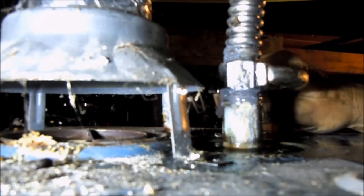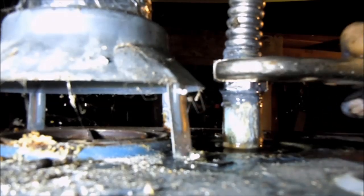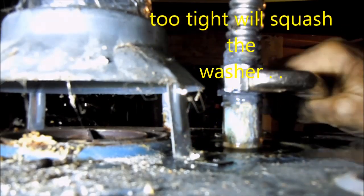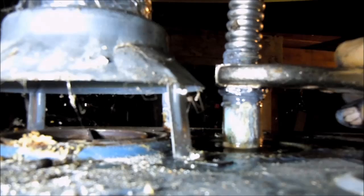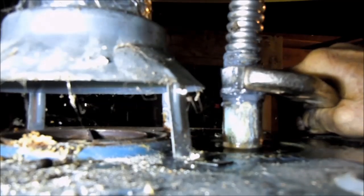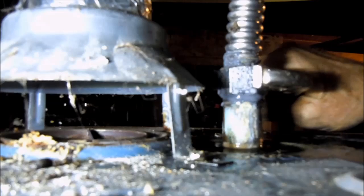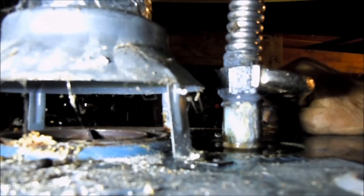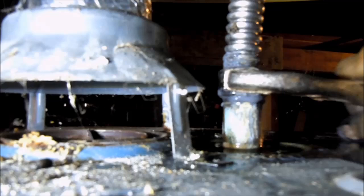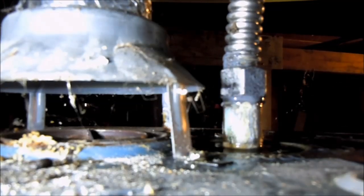So it's clamping down slowly but surely. You never want to over-tighten these — you just have to find that sweet spot, somewhere between hard and light. Some people say if you can do it hand tight and it's a clean thread you might be able to make it work, but hand tight plus maybe half a turn. What happens is if you go too hard it basically squashes the thread. So the moment of truth: we could go to the store and buy a new one for about ten bucks, or we try it one more time. Let's give it a try and turn the water on.